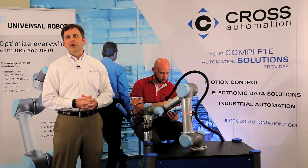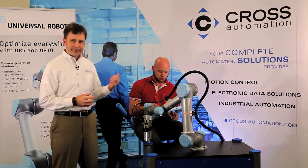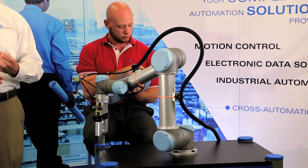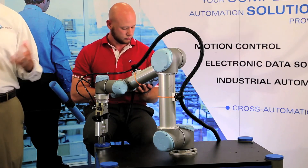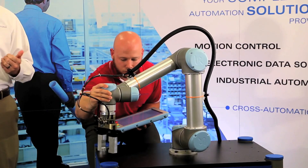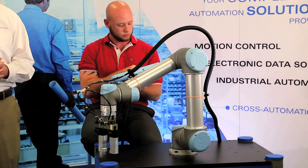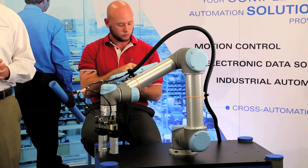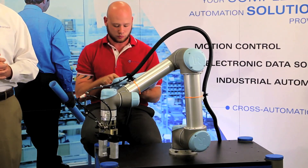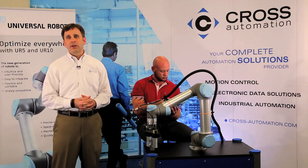One of the most unique features about the UR solution is the button on the back of the teach pendant. When pressed, this switch puts the robot into a gravity-free mode that allows the robot arm to be dragged into position. This is incredibly helpful when teaching the robot a new waypoint. Simply press the button and move the robot where you need it, push the teach button on the screen, and you've logged that waypoint. Should you need to fine-tune the location, you can do so via jog buttons, joint sliders, or manually modify the coordinates on the screen.